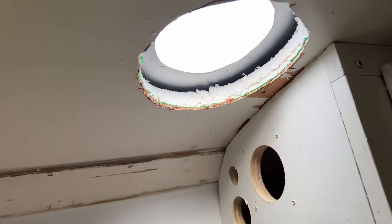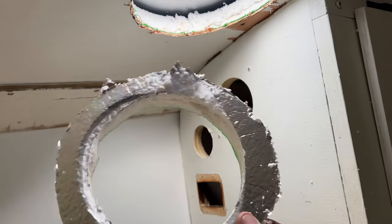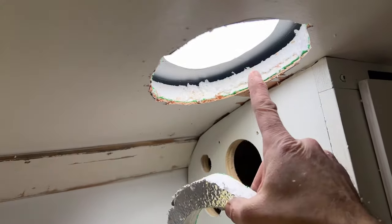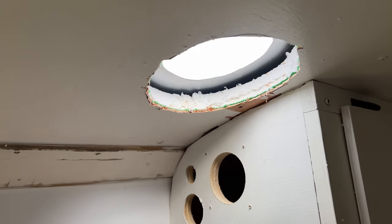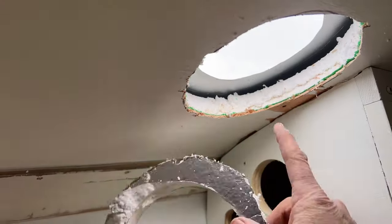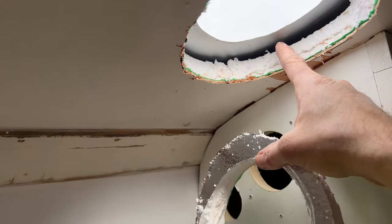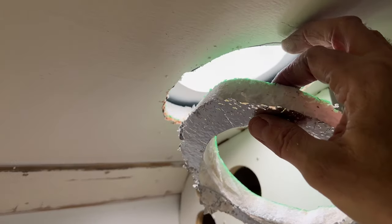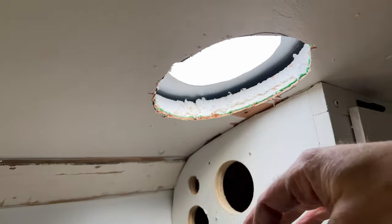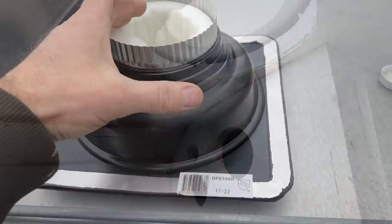I've got a ring of high-heat insulation — vermiculite — to put in there, replacing the existing ring that would just melt. That keeps it all sealed so hot air doesn't hit the metal and form condensation going down inside. Then I'll put the cover plates on, sealed really well all the way around to form an airtight barrier — we don't want condensation building and causing mold later.